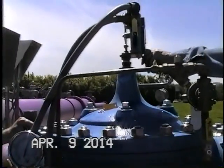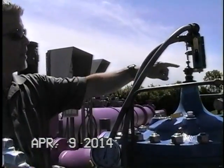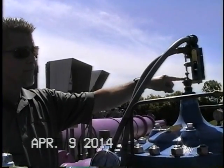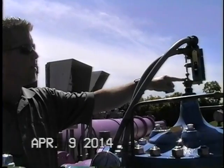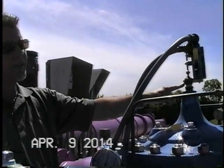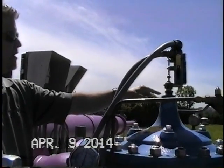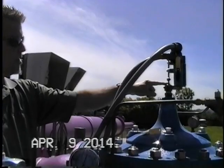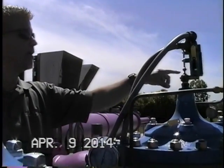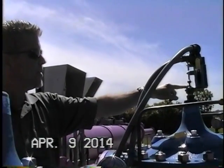There's an O-ring for that seal right here, isn't it? Yes, there is. I'm glad you brought that up. Very small. You don't want to tighten down at all, hardly. There's actually 2 O-rings in here. And no, I would not recommend opening this up to bleed the air out, and that's why they came up with drilling and tapping through the adapter fitting here. So every time you do maintenance on the valve, I would recommend changing out both of these O-rings inside the limit switch here.